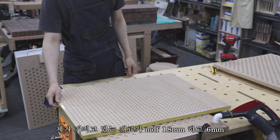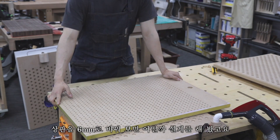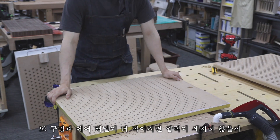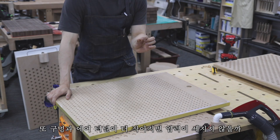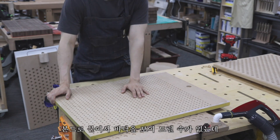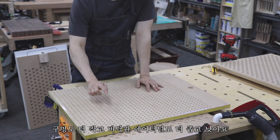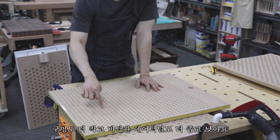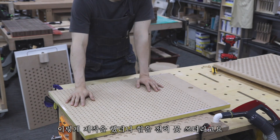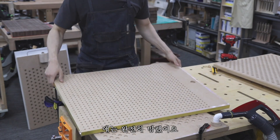The MDF I had available was 18T and 6T, so I tried switching the top plate to 6mm. I also thought making the holes and air tunnels smaller might increase pressure, so I made them smaller. However, since I had already glued this version together I can't show the underside — but the holes are smaller and the air tunnels in the base are narrower and shallower. This version had no holding force at all — it was a complete failure.